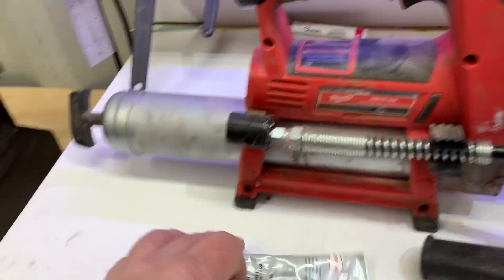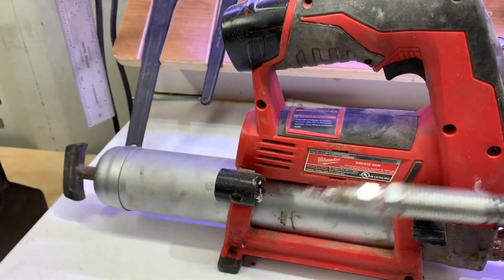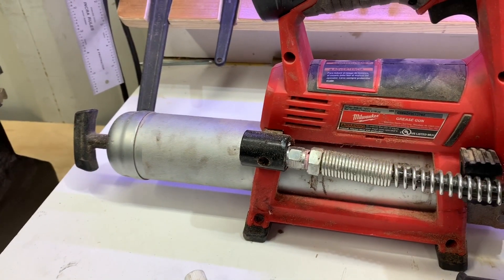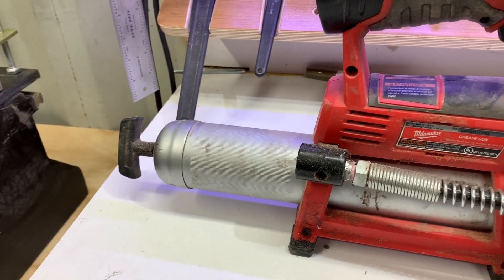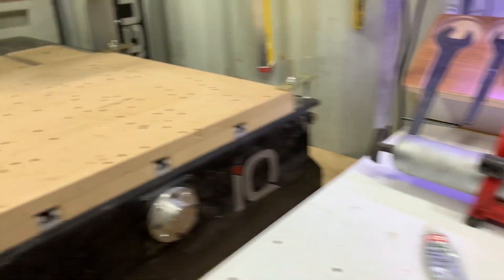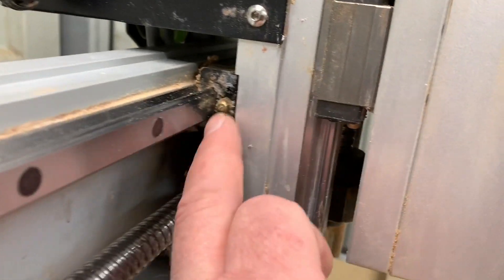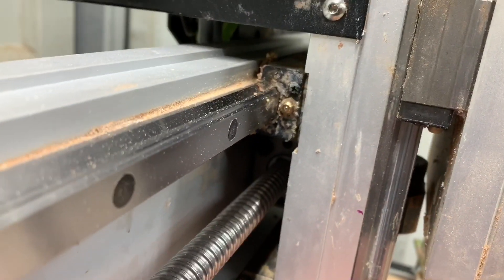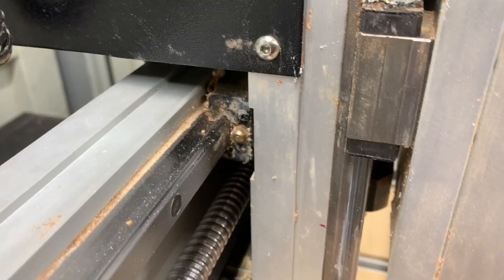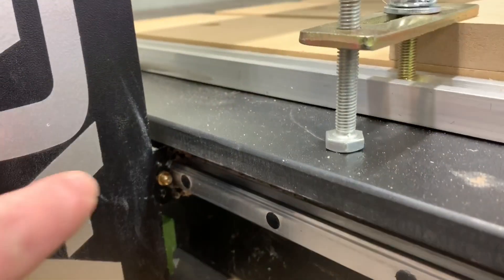I've got a little bit of lithium white grease here and a grease gun with a grease fitting. I got a tube of lithium white grease from Greg Distributors — it's food-grade lithium and it's the thinnest I can get. I use that to grease the bearings. You can see on my machine these grease fittings here, but there's no way to get a standard grease nipple on there. With that needle-type fitting on my grease gun, we can get on here.